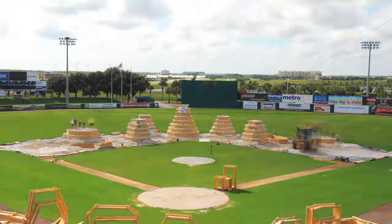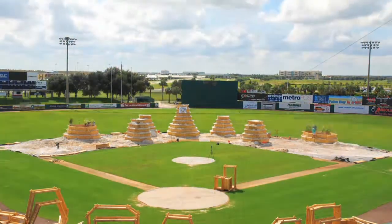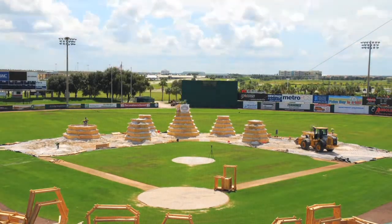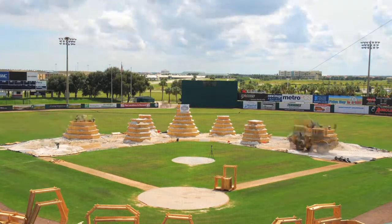You have a two-foot form — everything is in two-foot increments — and it seems to work very well, easy to climb on as well. Sand and water compacted, sand and water compacted until it's full, and then you put a smaller form on top and just do that until you're at the height that you want to go.